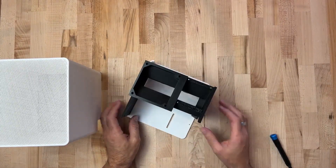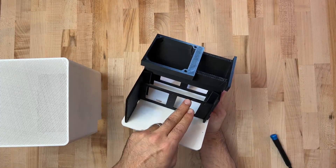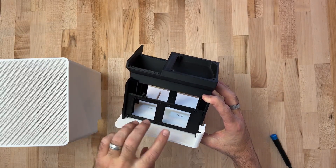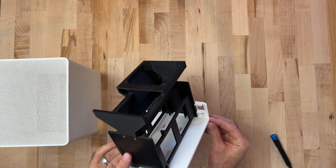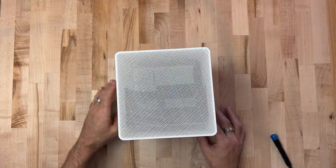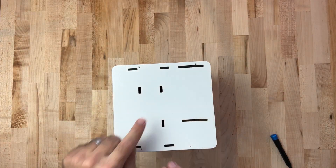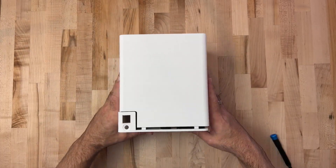So that's pretty much it as far as the internal frame — it's fully assembled at this point. Nodes one, two, three, and four are here, and then that's where our hard disks go. We'll also have some other components: our gigabit switch will go here with the ports facing this way, our DC-to-DC power supply will go in that space, and our little CAT6 network connection will go right in there. Once it's all put together, the lid just slides right over the top. The only other screws we'll use will be on the bottom — four screw holes that hold the unit all together nicely — and we still maintain that air gap at the bottom for ventilation to exit out.